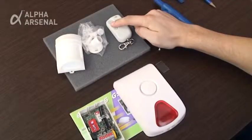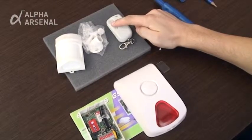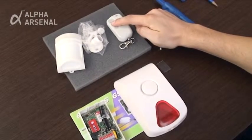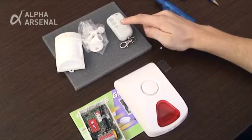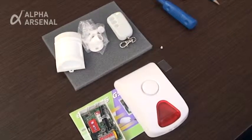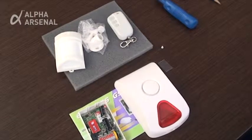After the string of beeps cease, a test alarm can be triggered. Following the triggered alarm, the siren engages and sounds. Press Button B to disarm the device. SMS notifications will arrive indicating a triggered alarm and that the device has been disarmed.